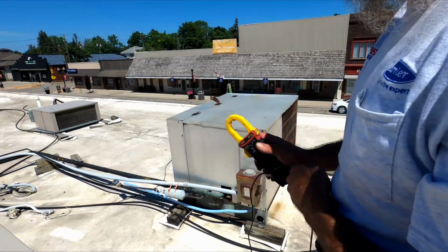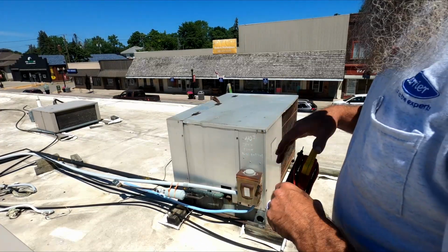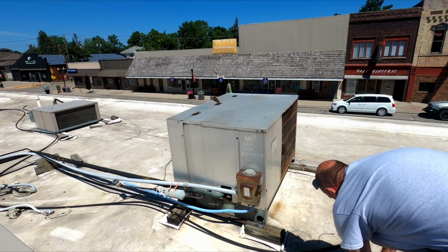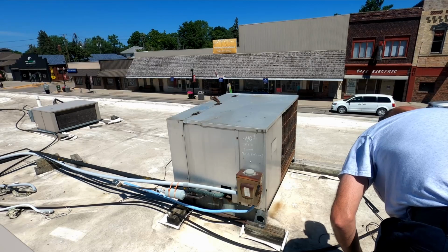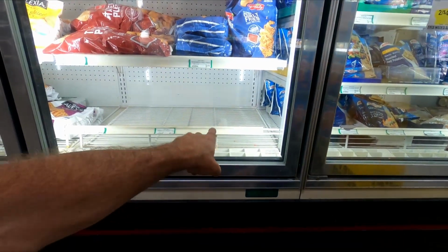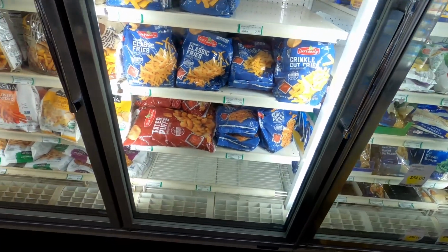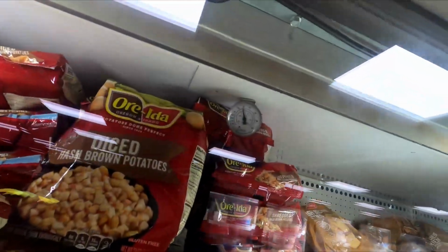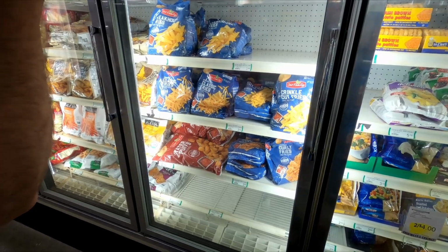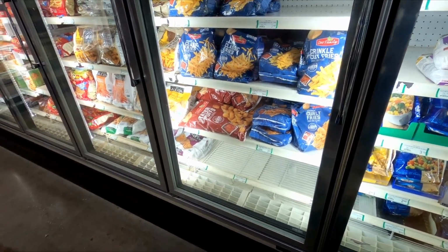Let this thing run a little bit and see what happens, but go downstairs, see if the vap fans are running. I had a fan termination down here in the coil. Not making. So for right now, this weekend, I'm just jumping the termination out. And we are down to 20 within about 15 minutes. So refrigeration side's working. So I'll come back up here on Monday, check the heaters and new fan termination.